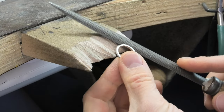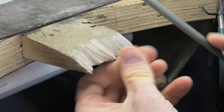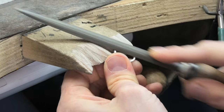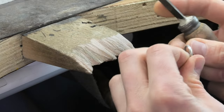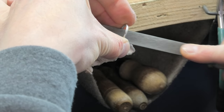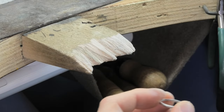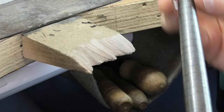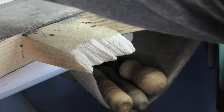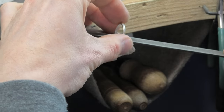You may as well properly clean it up to a papered finish stage. I'm just going to go over it lightly with my file, make sure everything's all nice and flat, and run it around the inside. It's got a bit of a blob on the inside from my solder this time. It's nice if you can get the solder to flood on the inside but not actually build up a lump, because then all it takes is putting it on your ring stick and giving it one or two taps - completely flat - and you can go straight to your paper whizzers to work around the inside.